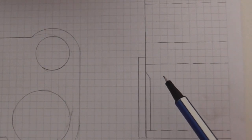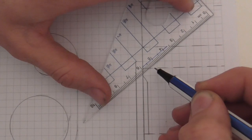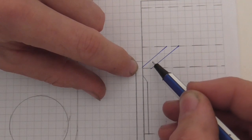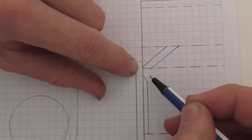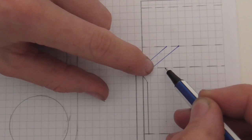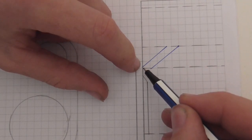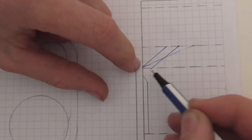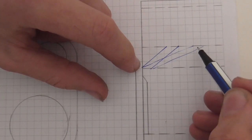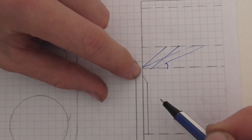Shown here is the end cover, and if we look at how the slot will actually break through, we're going to lose the corner here. The idea of all this arrangement with the cut-out in the end cover is to allow the steam to flow in right at the back of the cylinder and not interfere with the piston or the piston rings. If I let this slot go too far forwards we might start interfering with the back of the piston. Also I could have tried to do the slot in one go — right from this corner to the port — but the main reason I've done it this way is to try and minimise the gap in the cylinder. Also I'd be working with a very tight angle if I did that.